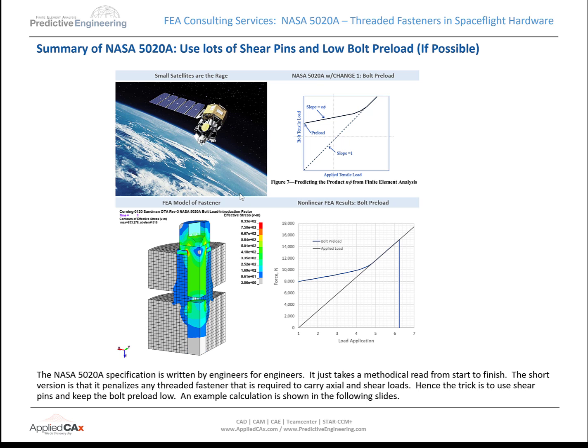What we're looking at here is — this is my short summary — space flight hardware: you've got to get it right out of the gate because you're not sending somebody up to fix a loose joint. On the right, that shows you where the fasteners should be; you want to stay where the curves don't meet, meaning you don't have joint separation. You have the load increasing the bolt preload, and it was really useful to plot this out. It gave us a lot of good insight — even after years of working with bolted joints — including why fatigue works so well: you don't get the oscillation and so on.